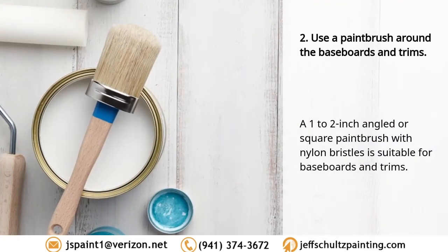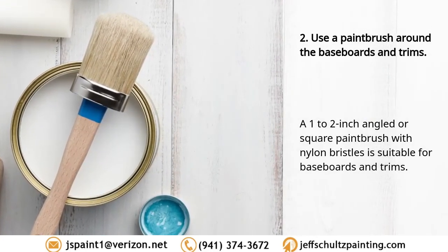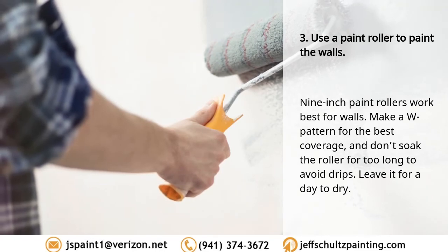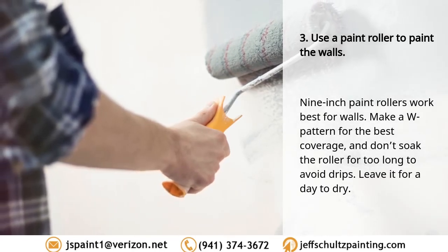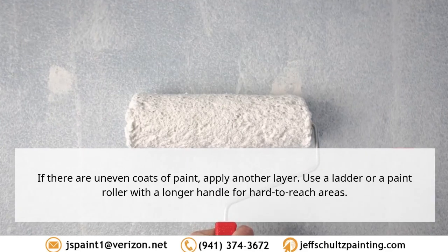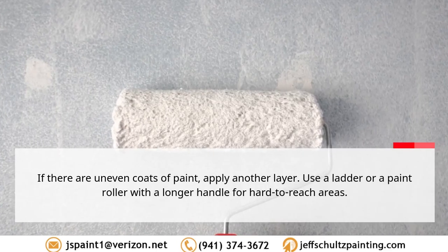2. Use a paintbrush around the baseboards and trims. A 1 1/2-inch angled or square paintbrush with nylon bristles is suitable for baseboards and trims. 3. Use a paint roller to paint the walls. 9-inch paint rollers work best for walls. Make a W pattern for the best coverage, and don't soak the roller for too long to avoid drips. Leave it for a day to dry. If there are uneven coats of paint, apply another layer. Use a ladder or a paint roller with a longer handle for hard-to-reach areas.